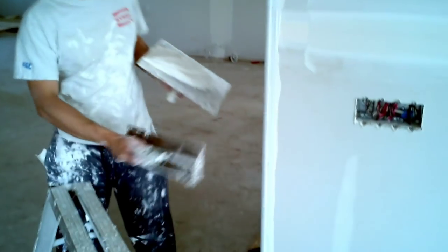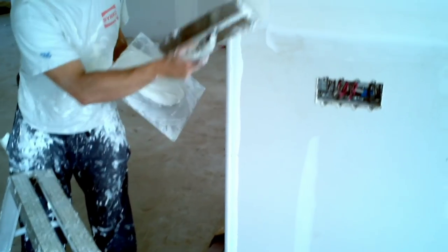You're going to want to clean your bead first. What I do is I run my trowel along the edge like this. As you can see, there's a little bit of chunks that just fly off. See that little bulge right there? There it came off. Because when I run my trowel along it, I don't want the little chunkies to go into the mud or to skiff off the edge of the bead because it's a piece of drywall.